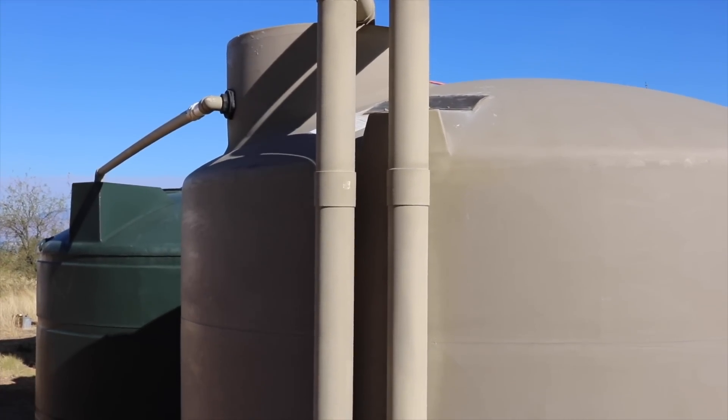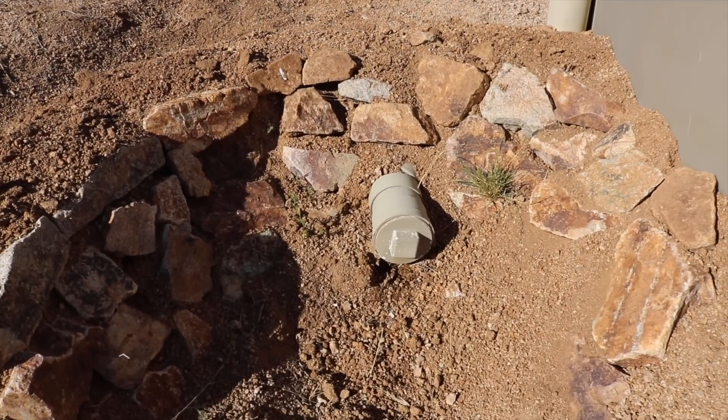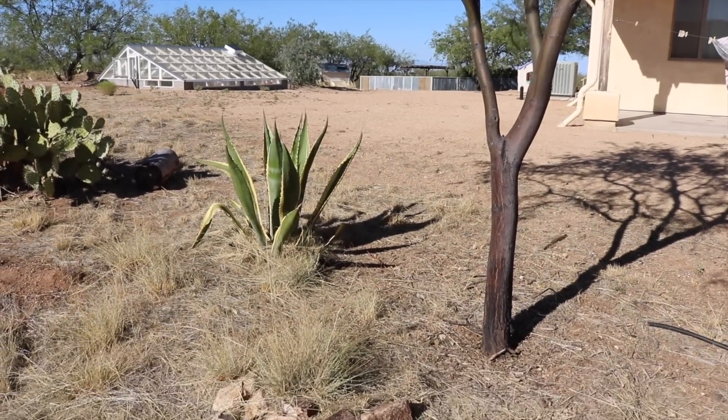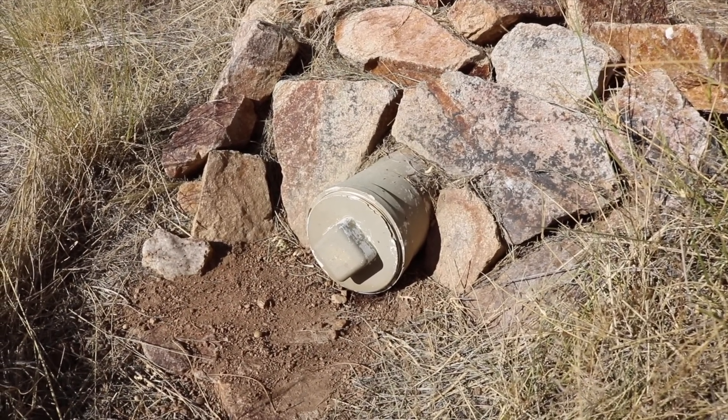The system can be cleaned of any dirt or debris by way of two clean-out caps — one located right here and the other one located right at the base of this tree right here. Did I do all of this installation by myself or did I hire a company? I hope I didn't hire a company because it's definitely not perfect, but yes, I did it all by myself. I did the trenches, laying the pipe, hanging the gutters, and placing all of the tanks except for the tan rain tank — I had a guy with a backhoe come help me dig the hole to place that about halfway in the ground. My father-in-law helped with the culvert cistern on the front, but everything else is pretty much by myself with my wife giving some moral support and helping from time to time.